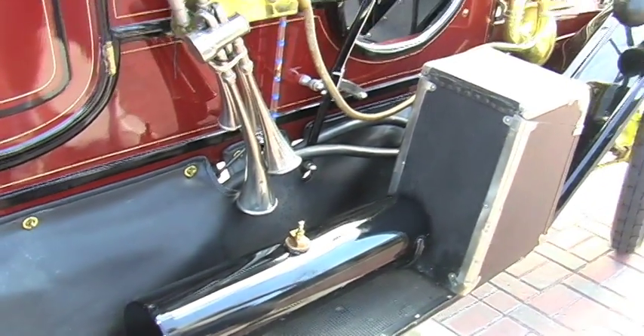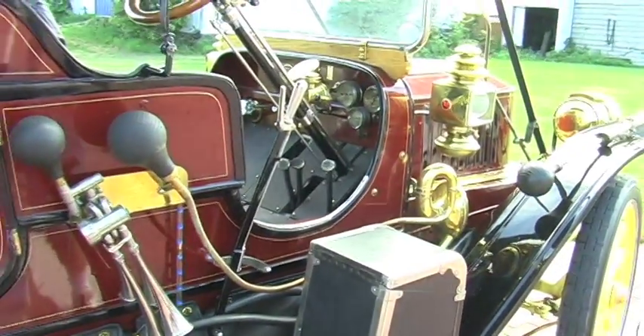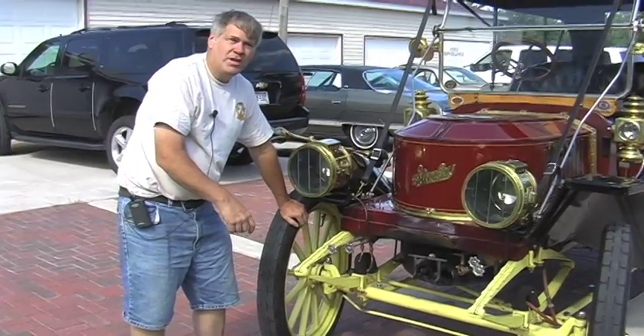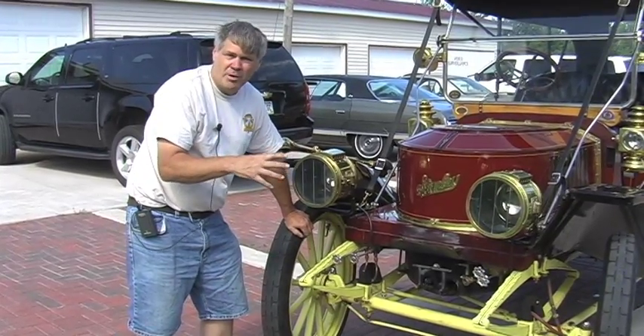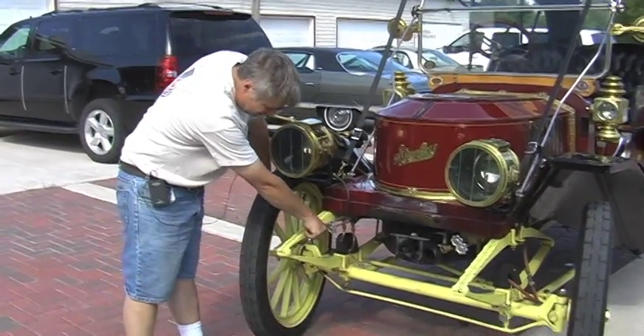You got to be careful you don't get too much muck — that's why I just like going to the faucets. Every so often you need to blow down the boiler to get any sediment, dirt, any kind of crud that might have built up over time. So you crack these valves here.